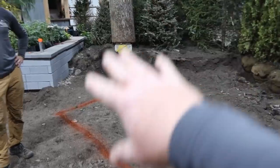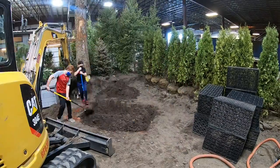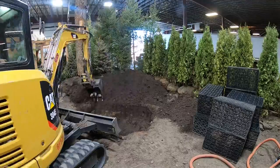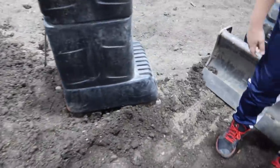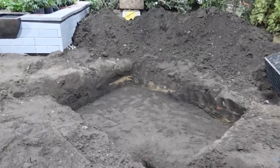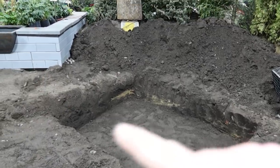We really want to use some massive boulders, so we want room for those massive boulders even on top of the aqua blocks, especially on the patio or viewing site. Next step is to dig. We got our hole excavated. Aqua blocks are sitting up to the side. We have our indentation for our pump vault and that boot to go in there. Getting that infrastructure done and set right is really important so that when we're setting our boulders, it just becomes that much easier. The bottom is pretty level. Next step is to put a layer of fabric down, then the liner, then fabric again.